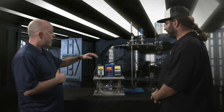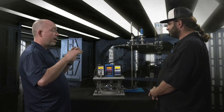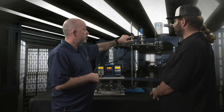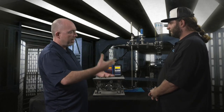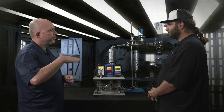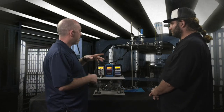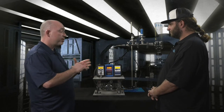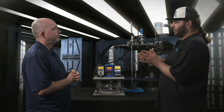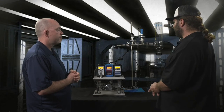Regarding where these sensors should and shouldn't be used: the Bullseye SVG-1 is great for short path distillation and pump down tests on rotary vane pumps, but it's not a good gauge for drying hash in vacuum ovens because it gets contaminated. Also, the sensor gets really hot, and with butane pressure buildup in a vacuum oven you don't want a hot sensor present. Additionally, the accuracy at 100–200 millibar isn't good, so a piezo sensor is better in that range.